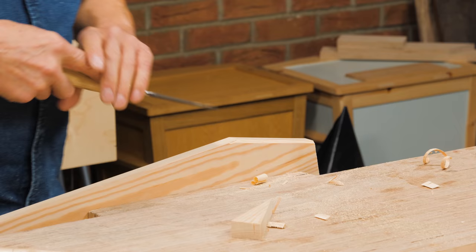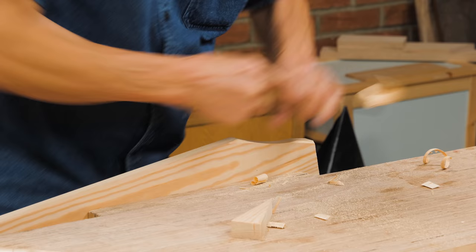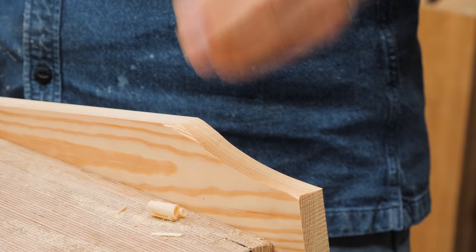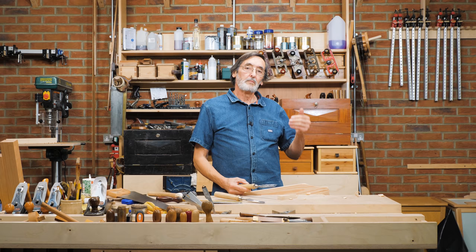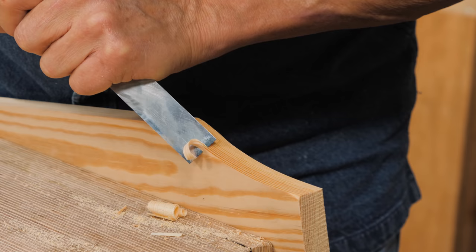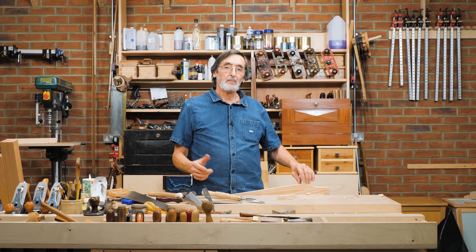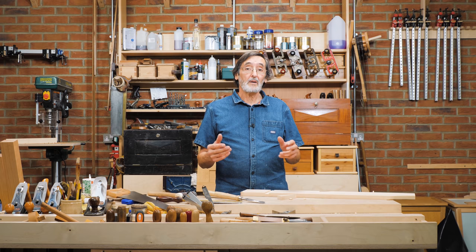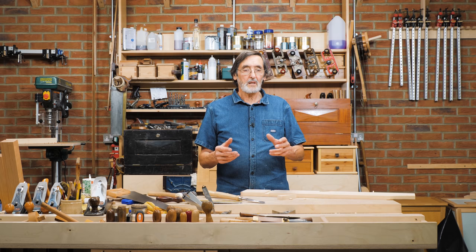What if this was a scallop? I want to create a scallop — I go in with my chisel like this and I create a scallop. Very simple. Bevel down for the scallop, flat face for the straight. If I want a bevel on the scallop I just go in with the chisel bevel down again. These are perfect applications and we use all the different types. These are just a couple of options to think about and practice with, and you can add many more because the chisel is so complicated and yet so simple.